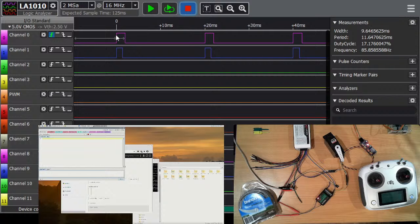It would then wait until a 20 millisecond period elapsed, and then it would transmit the second channel. Then, at the end of the next 20 milliseconds, it would transmit the third channel. And it repeated that until it got through all of the four channels, and then it would come back after a slightly longer delay and repeat the process. This allowed you to run multiple servos.